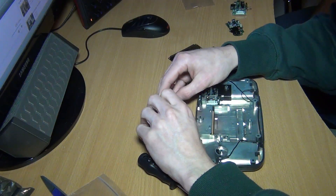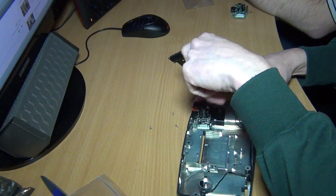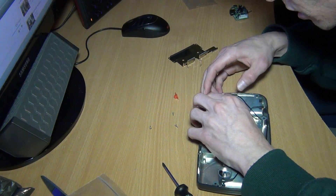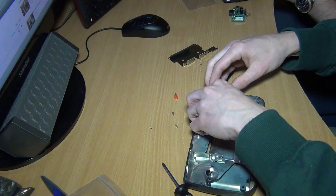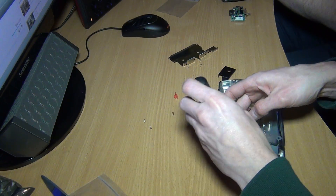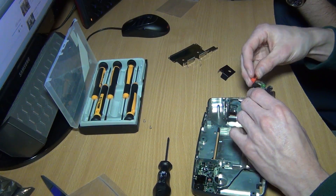To fix the sound board I simply had to remove the screws and take out the old sound board. Then remove the screws from the power board and remove that from the unit. Finally, putting the replacement sound board in, and finally putting the replacement power board back in.